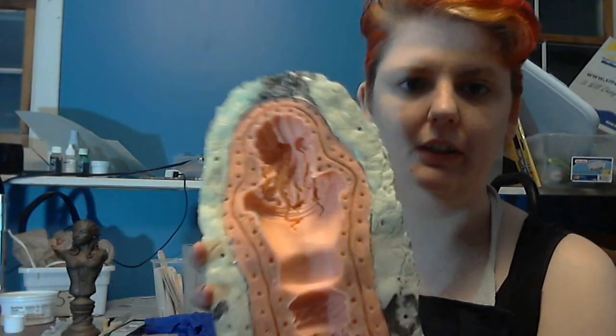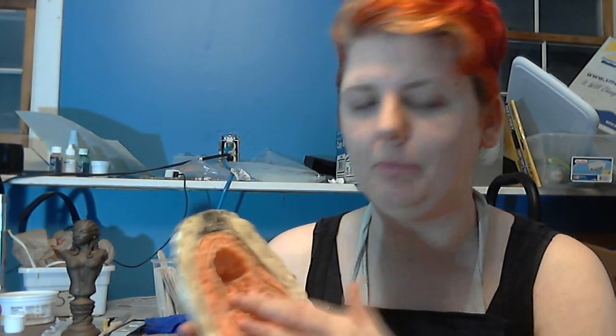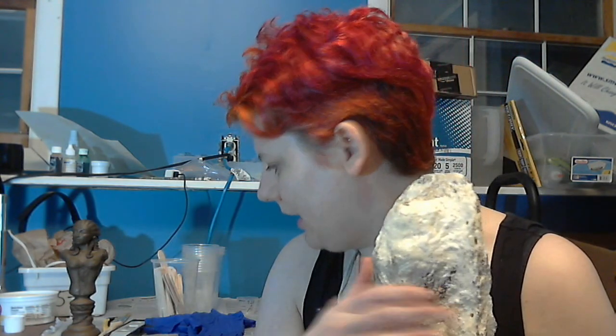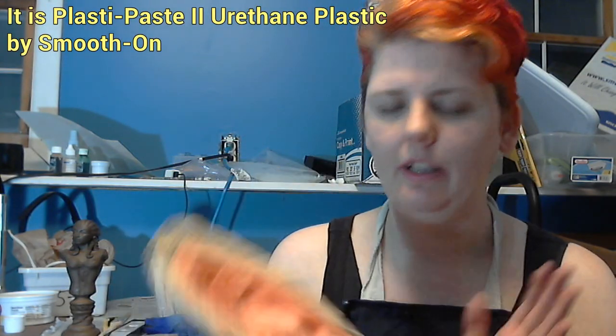Let me bring up part of the mold — there's the back half of the Lady Vinsmith mold. The first thing I'll be doing is powdering the inside of the mold. This will partly give a nicer finish, but it'll also make sure that the resin gets sucked into the little detail areas so we don't get bubbling. Because this bronze powder is really expensive and I do not want to wreck any of the bronze castings. This is a rigid mother mold — I can't remember the product name, but it comes in Smooth-On's brush-on kit. The silicone is Rebound 25. It's great to brush on.